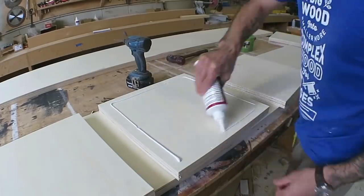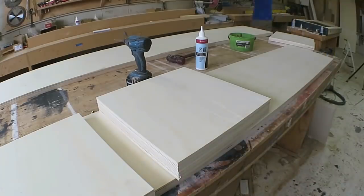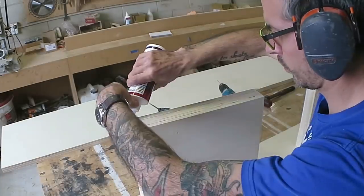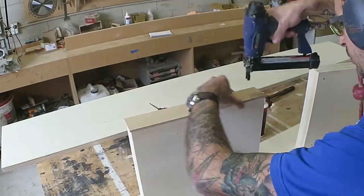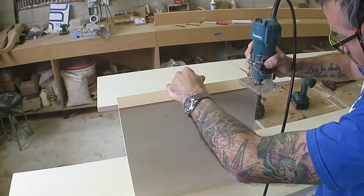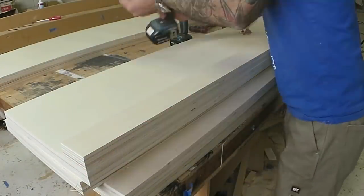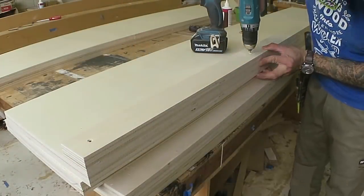The end panels of the lower carcass were double thickness — so everything that is thick is 60mm, all the rest is 30mm. On the 60mm panels I allowed for a 6mm MDF capping, which seemed like the easiest way to do that. So the top and the right-hand side panels needed to be 60mm thick on the face, but obviously it would be a waste of plywood to fill it all in, so they just have a false front there.